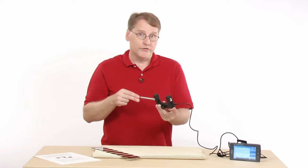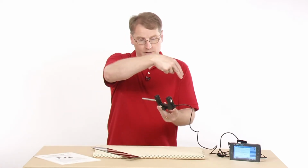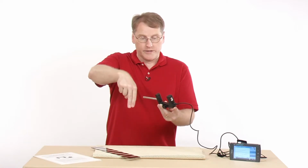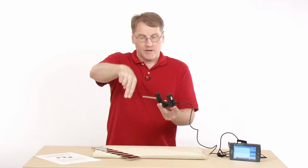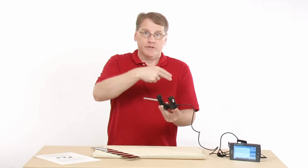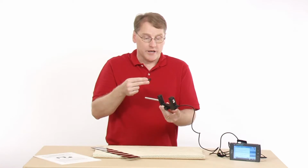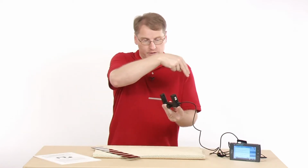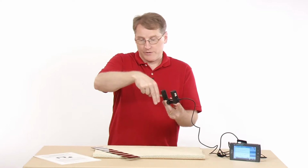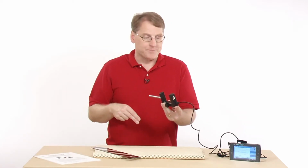The other is pulse timing. And pulse timing, it times from the time that it is blocked until the time it is blocked again. And so blocked, blocked again. And so there are times that you might want to do that. In addition to having it just be one together, you can have multiples of these, and so maybe you block it, and then when it goes through and blocks the next one, you might use that pulse timing.